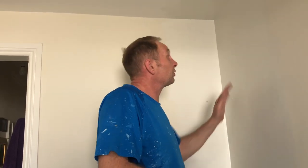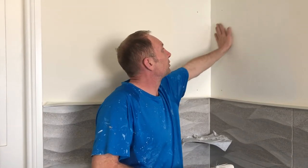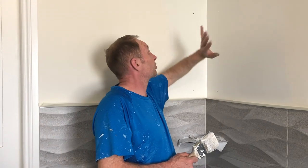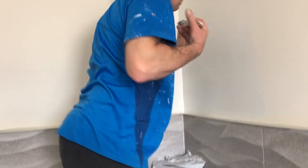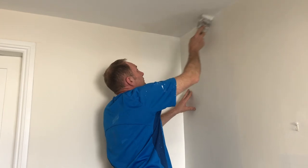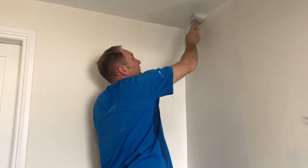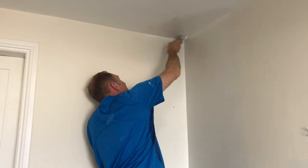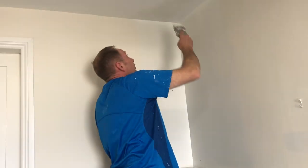Basically that's it - that's all we do. What I'm doing now is getting some white emulsion out and just coating that section up. It's all been d-nibbed - you don't have to d-nib, it's just because I've got bits in it. I'm going to coat that little section of ceiling up in white and get a couple of coats on it. I'm just doing it by brush because it's just not worth getting a roller outfit out for what's only about a square foot.